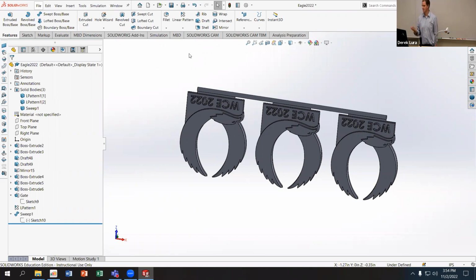That sound good? The next thing we need is some kind of reservoir for the material, or an injection point where the material is going to enter the cavity. If we're gravity molding, then this has to be some kind of geometry that we can pour into, so it's got to be some kind of funnel. If it is an injection mold, then it's really just a hole somewhere that pierces the mold, so it may just be a cylinder. Let's see what each of those looks like.